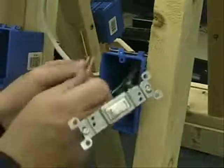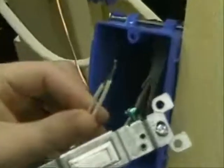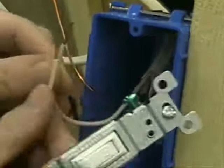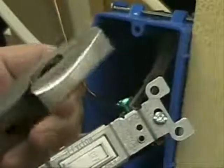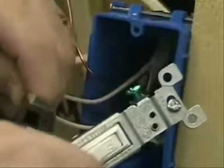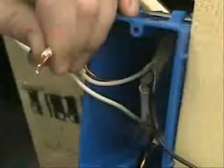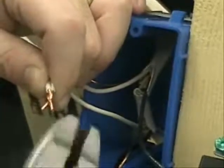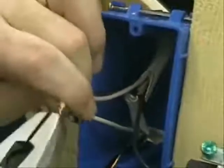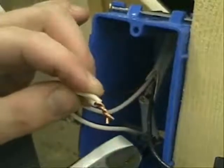What we do is put the two wires together and hold them side by side like that. I'm going to take my linesman's pliers and squeeze them together, holding them tight. It's important to hold these nice and tight. I'm going to twist them together using my linesman's pliers — you can see why these are so helpful with their nice big flat surfaces. Squeeze and twist, forming a little twist like that.